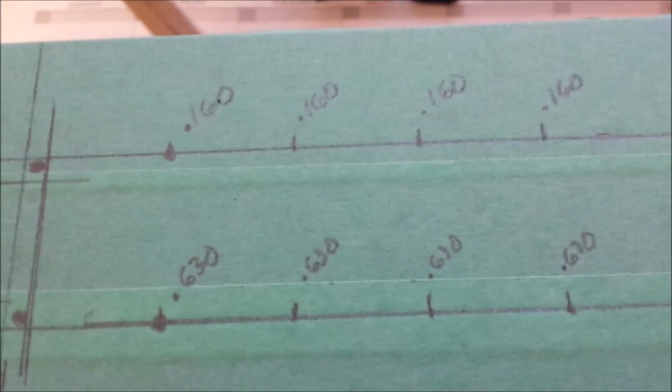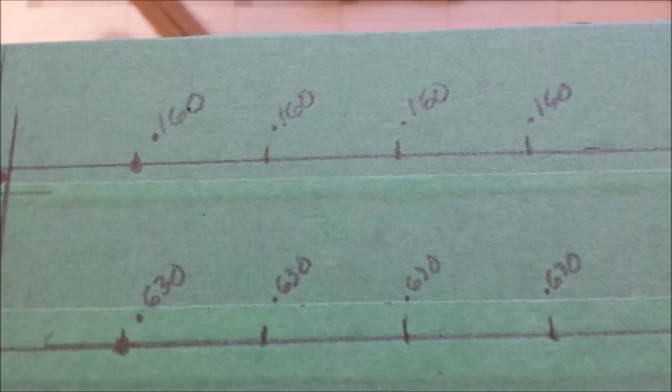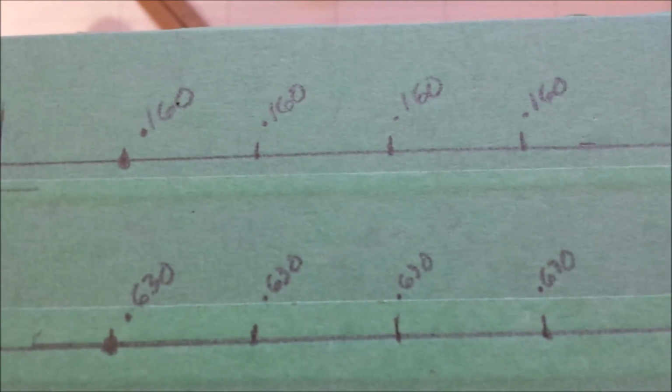Next, I'll come down here and I'll lay out the LEDs and the momentary switches for the 4 port indicators. Okay, I've got those laid out. If you notice, I wrote down the measurements of the holes that I'm going to drill for those right next to them. And then that gives me a little less than half of the case left if I wanted to eventually put something else in the case to expand it.